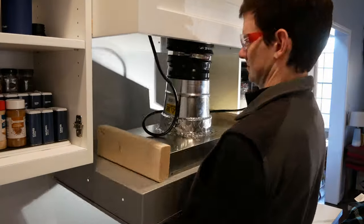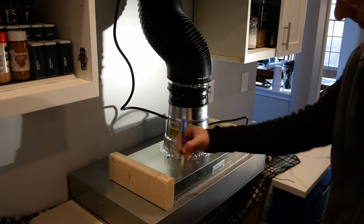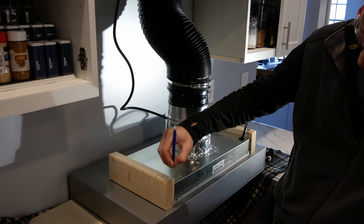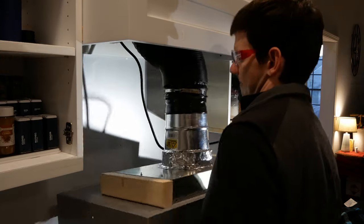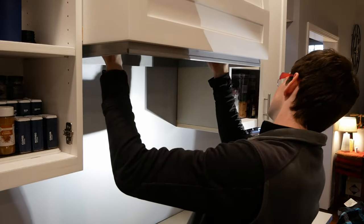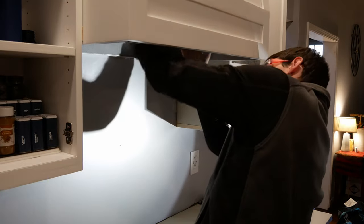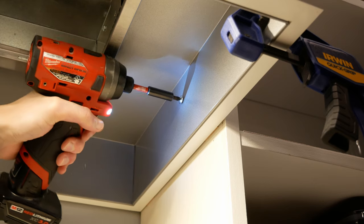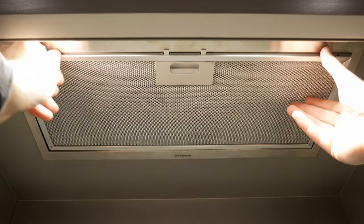I plugged in the fan unit, lifted it up into place — and another problem. Upon inspection I realized the tops of the 2x4s the fan unit is mounted to were hitting the lowest cross support inside the cabinet and needed to be trimmed flush with the top of the fan unit. I got those trimmed up, then lifted the unit up slowly keeping it level as I wedged it into place — and it fits. I center punched, pre-drilled, and screwed through the mounting holes to attach the unit securely. Lastly I installed the grease filter and we've got ourselves a fully functioning range hood.